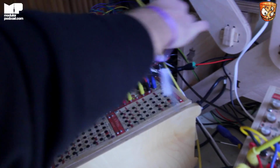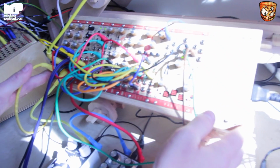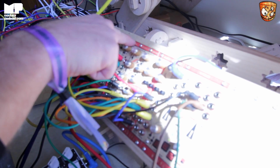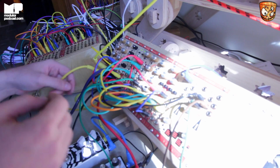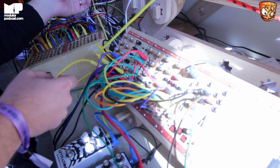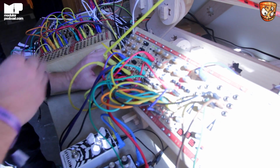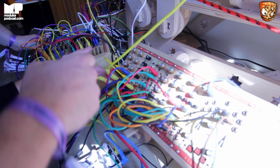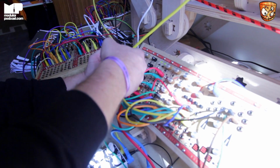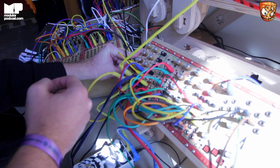So basically, now the sound coming from the guitar comes to this modular system. And these are the 3 new modules? Yes, so basically the Hendrickson, Dynamo and Tromso are the new modules we just announced yesterday. Hendrickson basically takes the signal from the guitar, amplifies it to the module level. You have a module level indication in here and the gain control. And then it has an output jack, again with a level control, and it indicates the guitar and line level.